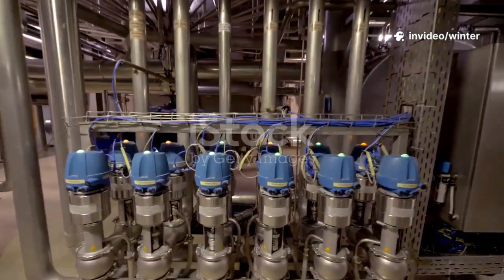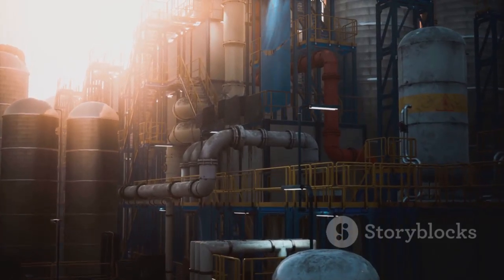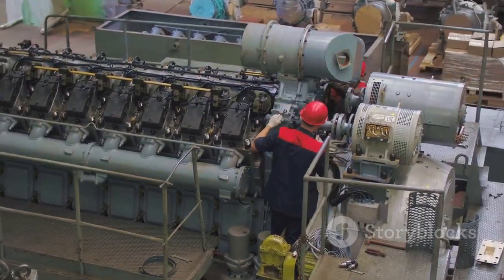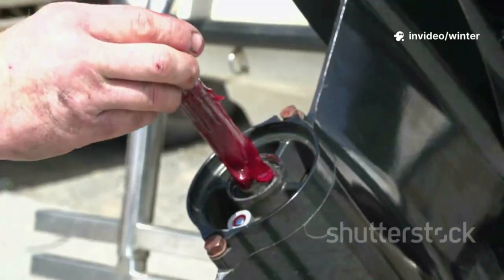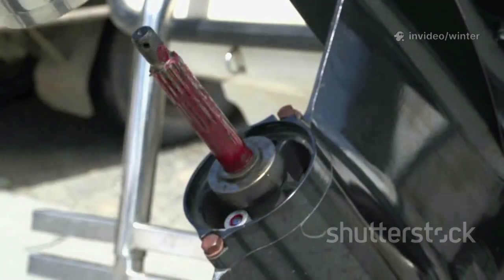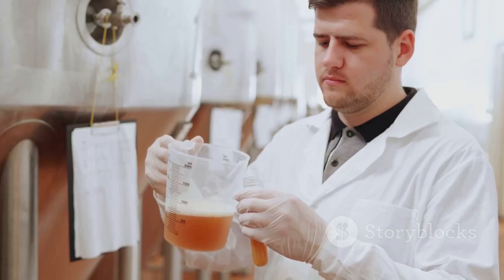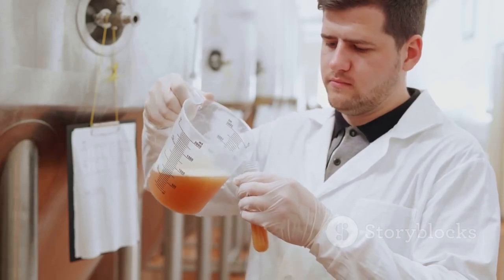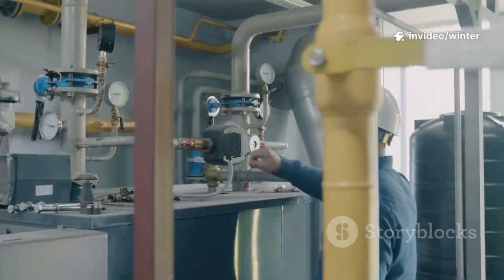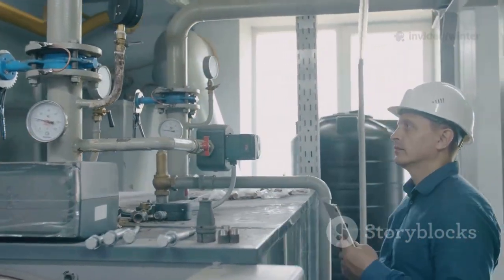In a chemical plant, a cooling water pump suffered repeated bearing failures, causing costly shutdowns. The team replaced bearings and did quick alignments, blaming bad parts. A reliability engineer investigated and found over-greasing, poor installation with hammers, and water contamination from washdowns. Grease analysis showed high water content, enough to destroy bearings. The fix was simple: switch to laser alignment and upgrade to bearing isolators to keep water out.